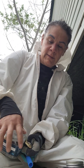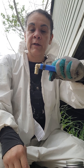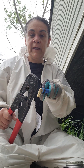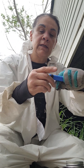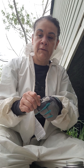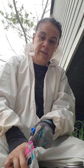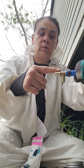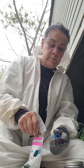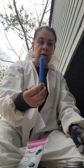These are called crimping rings. You put the little crimping ring on there, then put a straight or bent fitting — whichever you need — and take the crimping tool and go around the ring and pinch it closed. Crimp it tight so the fitting won't move and water won't leak. That's what you use and that's what it looks like. They also have T-fittings so you can connect multiple lines going different directions.